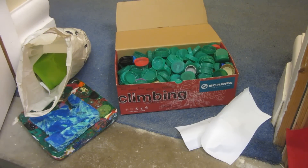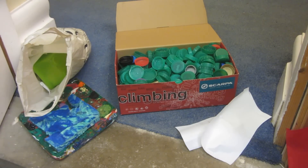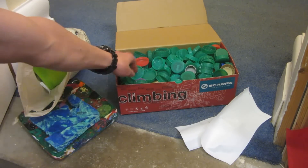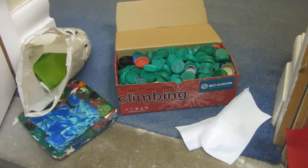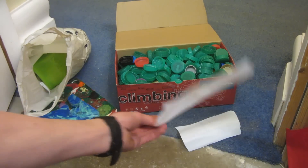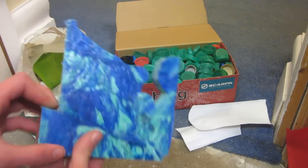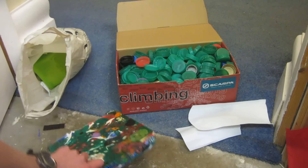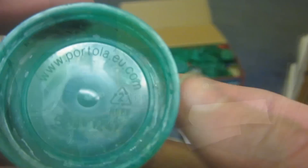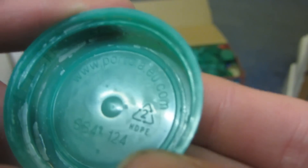The plastic I'm using is HDPE — high-density polyethylene — not low-density polyethylene, which is weaker and has a lower melting point. My source is HDPE bottle lids from milk cartons and fizzy drink bottles. You can also use white milk carton material or HDPE gallon buckets. HDPE can be identified by the number 2 within the recycling symbol, with HDPE or PEHD printed below it. I've shown how to make sheet HDPE in past tutorials — links are in the description.